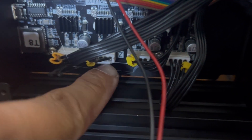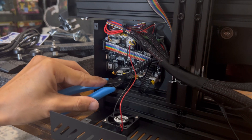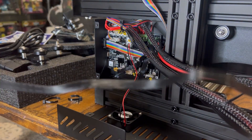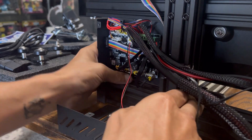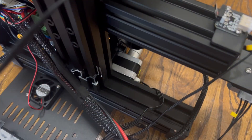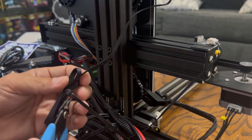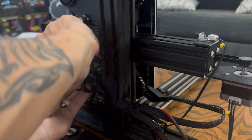You can see the X plug and the E plug for the extruder, and there's the Z harness. Unplug that one and fish that old harness out, then install the new one. All of these harnesses are kept in place with a small bead of hot glue, so go ahead and remove that. Once unplugged, fish the old harness out and get ready to install the new one. This kit comes with cord concealers, so if you want your wires to look as factory as possible, slide that on the harness, plug the single end into the Z port on the motherboard, and plug the dual plugs into each stepper motor. Then do a little wire management — zip tie what you need and use cloth tape or electrical tape to keep wires in place through the channel, making sure the cover goes back on with no obstruction and nothing getting pinched.